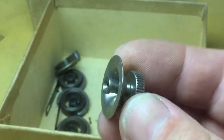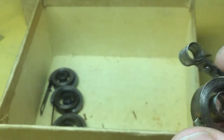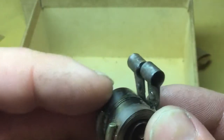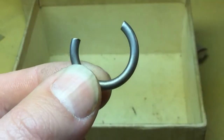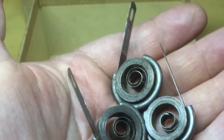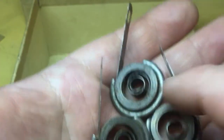A style one A and style two alarm set knob. A Baby Ben alarm spring. I thought this was for a series 66 clock — I think that's too small to be a chime alarm mainspring. And then here's two of them — I'd have to match them up with something in a package. That could be the mainspring for the alarm side of the chime alarm. A mainspring clamp for a Baby Ben or chime alarm mainspring. And then three very dirty but usable if cleaned mainsprings for either a Baby Ben or chime alarm — I need to get my calipers out and measure these to see which is which, because there are different part numbers for those springs.